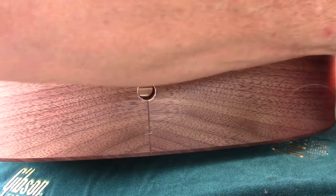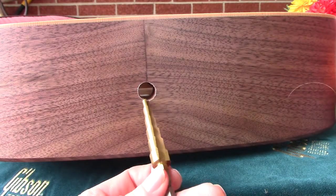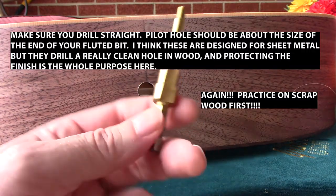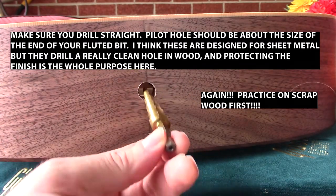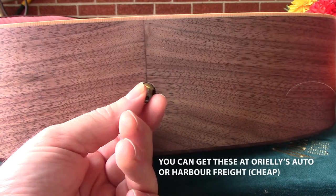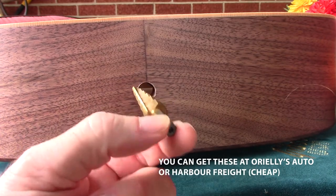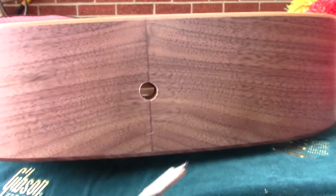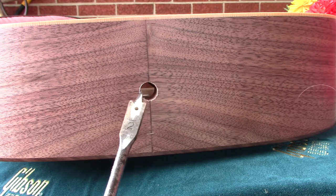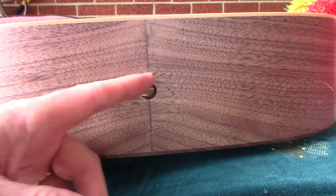After you drill a little pilot hole, your best bet is one of these step bits, because a regular drill bit is really bad about chipping out around this area. After drilling the pilot hole, let the step bit follow the pilot hole — this one is one half inch at its widest portion. Don't go in too far and get your drill head against it, but that's going to put a clean end in this hole. Then go in behind that with a regular half-inch bit. That way you've already got the outer edge cut clean and you're just going to wallow out the rest of the hole. The thing you're mostly concerned about is keeping this outer cut nice and clean.